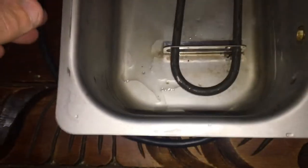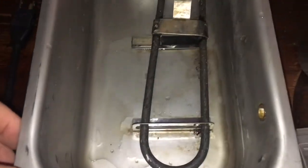These pans — if you clean them up every three to six months for your customers, take these things apart and wash them, scrub them with a green and yellow 3M sponge — they'll clean up okay. But this thing's only about a year old and I can already see corrosion starting in the back of the pan, going to go right through the actual pan itself.